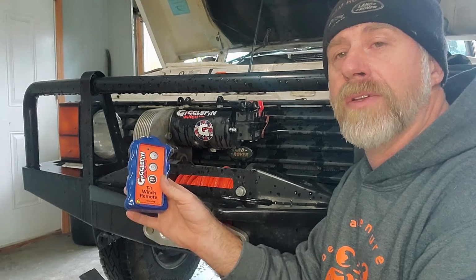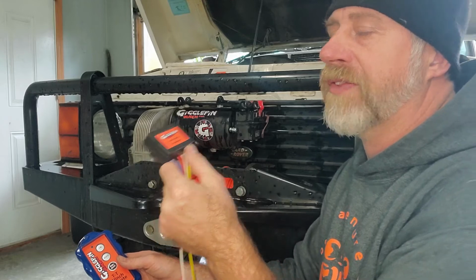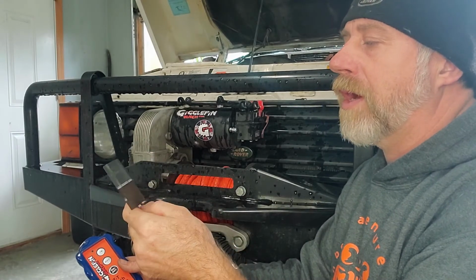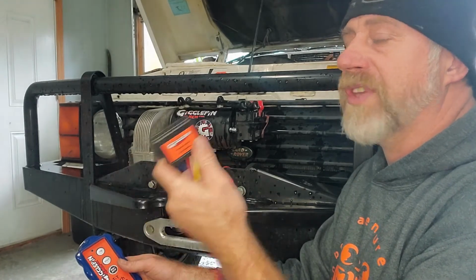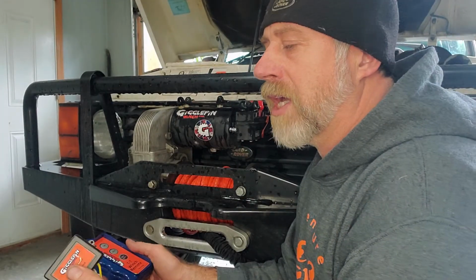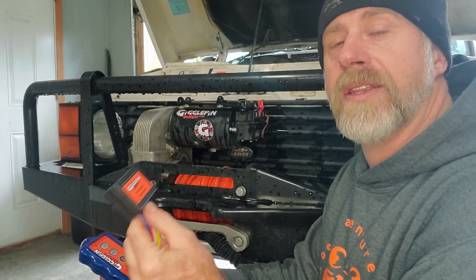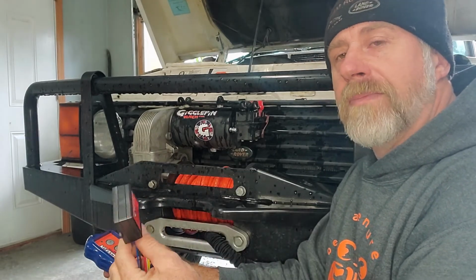If you got good batteries, and you're confident with that, well, then you still have your transceiver box. Usually if there's something wrong with the transceiver box, you can take it off and shake it. If you hear something in there rattling, then it's blown. That very rarely ever happens, but it does happen. And these need to be protected. You can't have these out in the rain and the mud constantly. They're not that waterproof. They will get moisture inside there, and things will corrode and eventually pop.